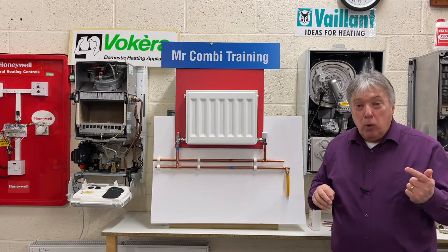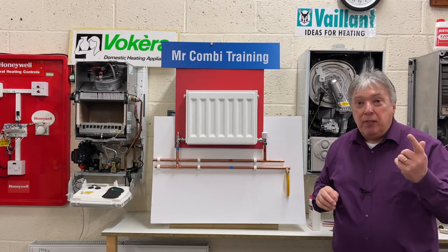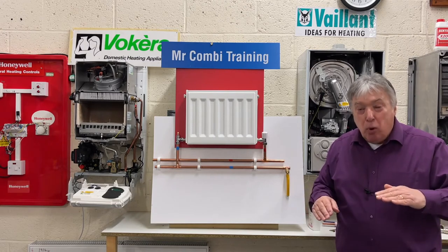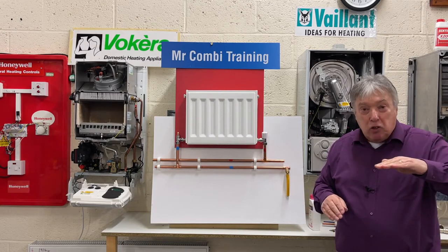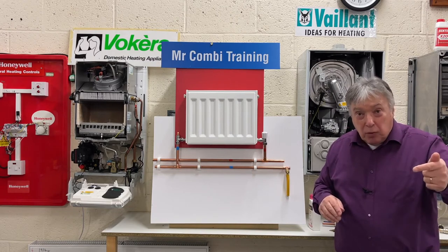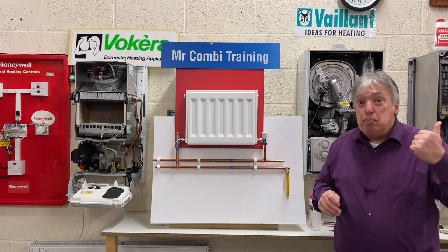If it's possible, pop up into the loft and just double check everything is now finished. That the little tank in particular, the ball valve is now set up and then switched off, and it's a long way from the overflow pipe, and check the overflow pipe. And also, while you're there, have a look at the big tank.